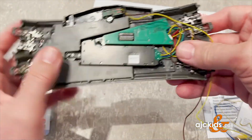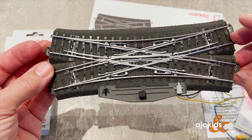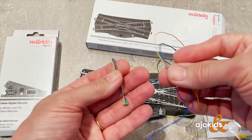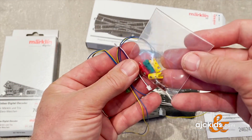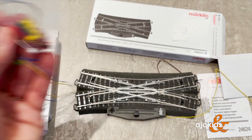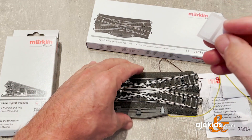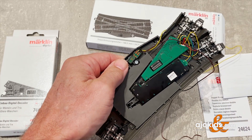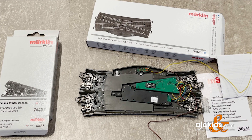What remains is to set the digital address on the DIP switches — an address of your choice. Then you can take the little label, write the number on there, and stick it on the decoder. The wires that are no longer needed can go in your parts bin — the Trix wire and the analog plugs are not needed, but very handy to have in your parts bin. And that concludes how to digitize the turnout, the 24-6-24. Write the number on the label and stick it right there. I hope this video was helpful to you. Thanks for watching, and I'll see you next time.